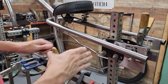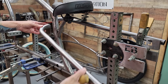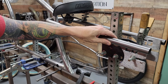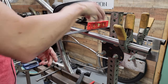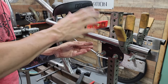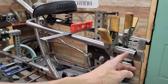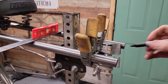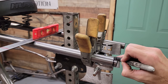Now the upper legs are mounted — the holes were already drilled into the frame, so the tube slides into that hole. You don't have to do it that way; you could cope and fit it to weld it. I'll get a couple of clamps, throw that on there, and measure out to make sure the back is straight. Once I'm leveled out I'll draw a line where I want to cut the bottom of the leg, then trim that little edge off and cap it.